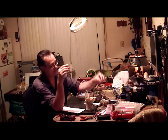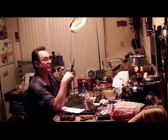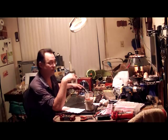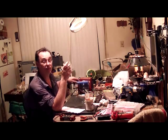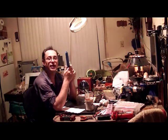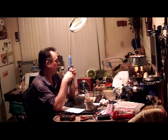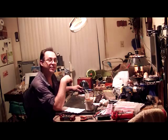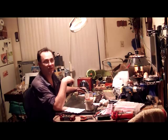Test lead clips — you never have enough of these. A 30-watt or so soldering iron. You want to keep that tip clean — clean it often. They have a very affordable desoldering bulb. This is a pump. I think it cost me like maybe $7.00 — the vacuum pump or the braid. I try to use the pump first to save the braid. I'm really cheap.